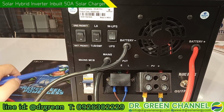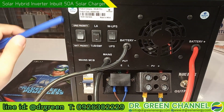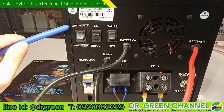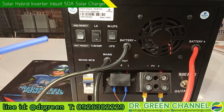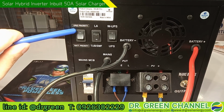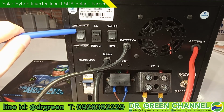But if you set the dip switch to grid priority, it will choose to use the grid power once the sun sets. That means the remaining energy will be stored in the battery. If we set the configuration like this, it is suitable for a location where power outages happen very often.